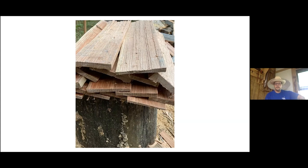This is also the same red oak log, but these pieces are going to become the back slats. That same technique of riving — splitting the smaller pieces along the fibers. This particular red oak, I was able to split some of these down to almost the final dimension, which is 3/16 of an inch, about a quarter. That just makes it a lot easier to then use a draw knife and spokeshave.